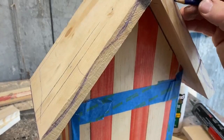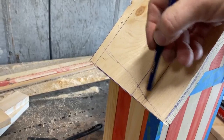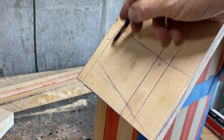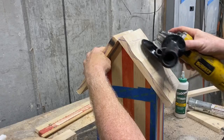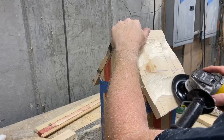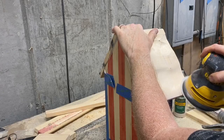I started on the roof, and for the roof I'm going to use a larger piece of wood — some scrap 1x10 that I had around. I glued and tacked that on into place. Then I drew some curves along both sides and the top because I want to make this roof almost like a waving flag. I'm going to use a disc grinder with a grinding tool to slowly grind away those grooves, then round it off with an oscillating sander and 80-grit paper. This is going to give the illusion of a waving flag.